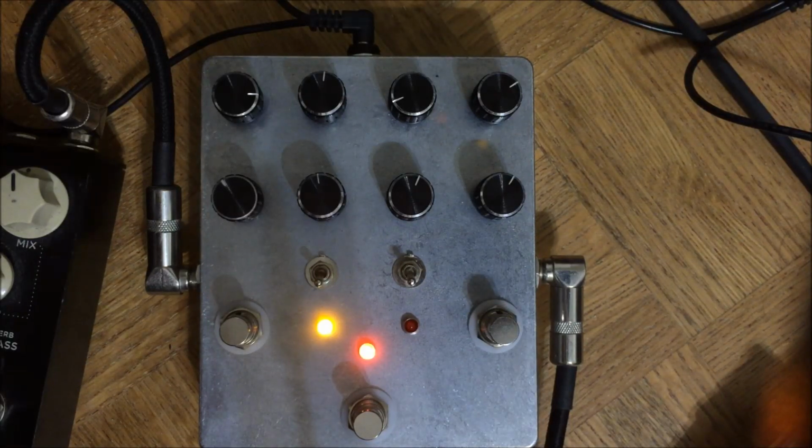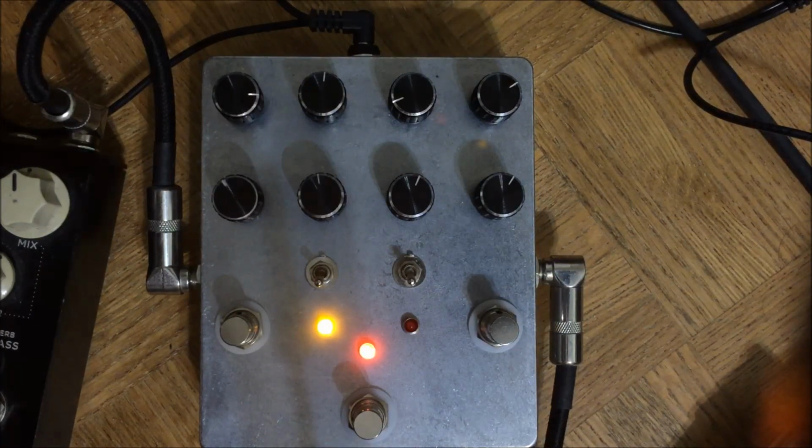And actually, if you were to do it with a wet dry wet rig with 2 wet amps and spread it that way, that would actually be pretty cool. Just have a central dry amp, and then have a splitter to 2 other amps, and then have this delay go to both of the wet amps, and then you have that central sound with the echo sweeping off to the sides. But you know, that's for the ambitious gear users out there. For the rest of us, it's just a little fun thing to have.